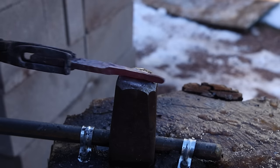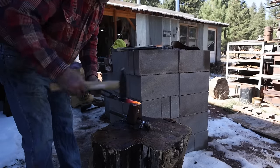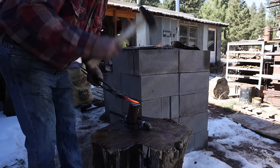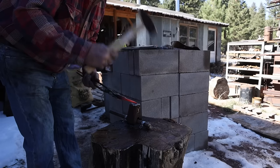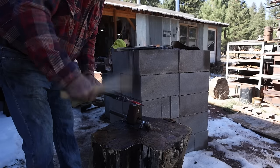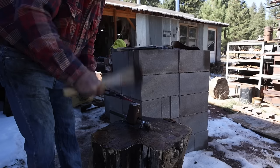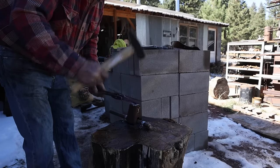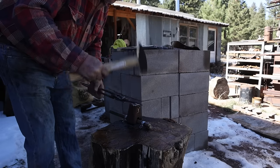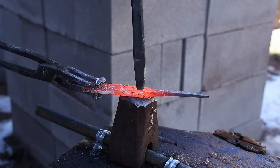It's warming up, but things are still cooling off awfully fast, so you do have to keep going back to the fire. You can certainly get this stuff done working outside with a simple setup. You'll be happy with a larger anvil that has all the bells and whistles like a horn or hardy hole, pritchell hole, and certainly having a roof overhead that provides some shade so you can see the colors of the material would really help. But this is entirely possible if this is where your budget leads you.